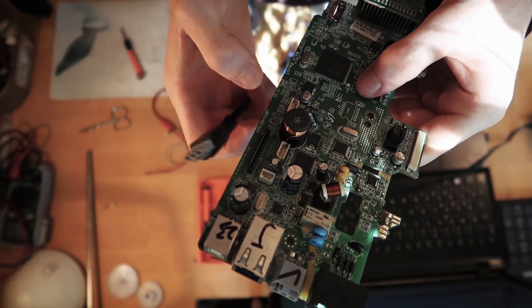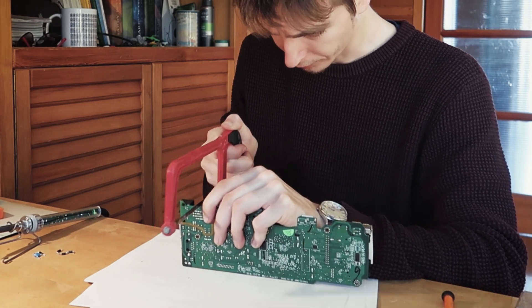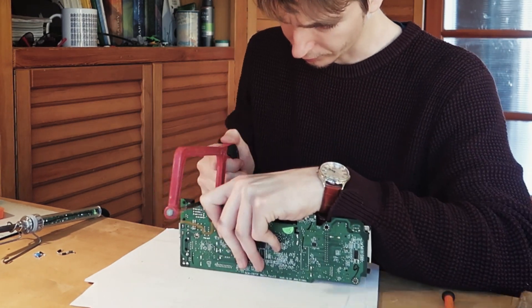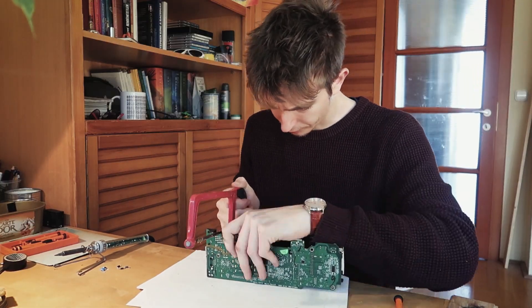On this motherboard I found this plug's mate, so I will cut this corner down here and solder two wires to the ground and the 16 volt pins. I will use 16 volts for this.